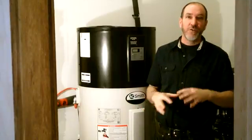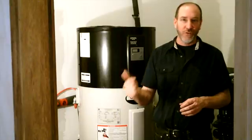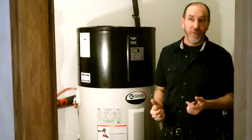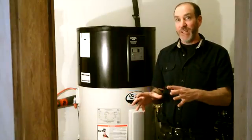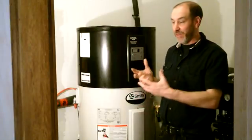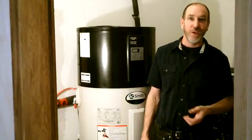The water heater here is part of a comprehensive energy efficiency strategy we've been doing with this whole house: super thick insulated walls, great windows, airtight building envelope, air-to-air heat pump to heat the air efficiently, and then this to cool it in the summer. We don't need a whole lot of heat to heat this place in winter, and we don't need a whole lot to cool it in the summer. This thing actually provided us with all of our cooling needs — we do have the split heat pump that runs in cooling mode, but not once all summer did it ever actually go into cooling mode. This thing kept the house as cool as we needed it.